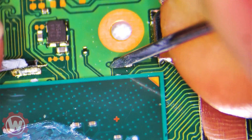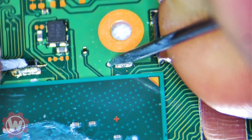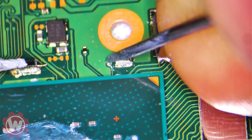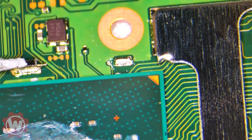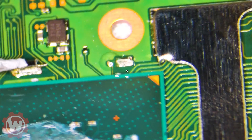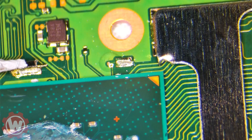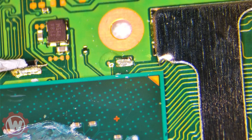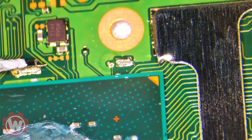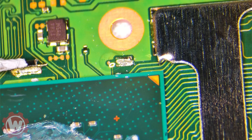Carefully — this tool is sharp, so sharpen yours if it's not, so that you can easily scrape it out. You want to scrape this paint or whatever it is that's on there, on the masking of the board. Now that it's scraped, you add a little bit of flux. This is the way I do it — I'm sure there's other ways, maybe even faster, maybe even better, but this works for me. If you guys have any input or ideas, you're always welcome to share them in the comments. Like and subscribe if you like the video.